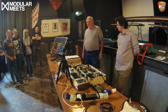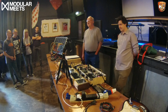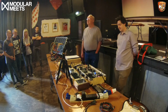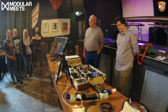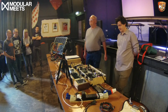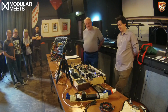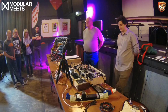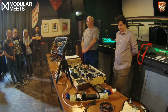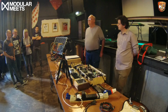The preamp looks, in terms of function, not unlike a Marshall JCM 800. It's re-implemented in FETs, but the basic tone shaping and distortion is exactly the same. So a classic guitar amplifier, and the tone stack is also straight out of Marshall. So the tone controls act exactly as you would expect a guitar amplifier to handle. On the side, it's got voltage control of gain. The important thing, how hard you push the preamp, and so what distortion you get, is voltage controllable. And that has some uses which I'll come to.